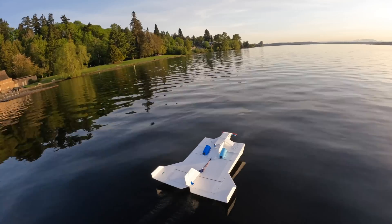I think this control loop worked well in the past because it was paired with an aircraft that already had a natural self-stabilizing feedback loop to stay in the ground effect, so the controller just provided a little help to resist disturbances. But with this plane there is no self-stabilizing ground effect feedback loop, and the sonar controller isn't good enough to do everything on its own. I'm not sure if that's because the sonar sensor is too slow or what.